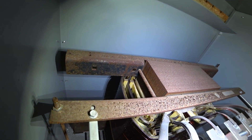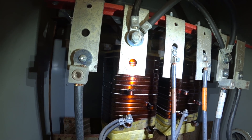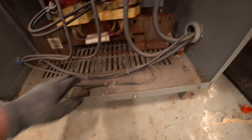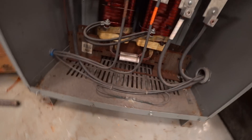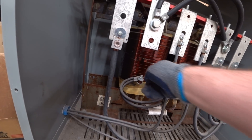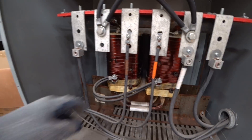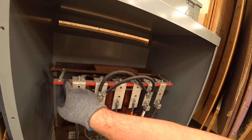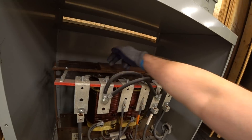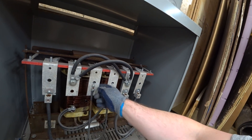Looks like hundreds of steel plates, and then we have copper windings. We've got a ground on each side — they both come in from this port here and that port, they come to this ground. Looks like you can pull off at different points. And they've got a bolt through here so that they're making a jumper, jumping from one side to the other. This is a piece of fiberglass being suspended off from this channel, and that piece of fiberglass supports these bus bar connections. They're grabbing onto the transformer at different locations.